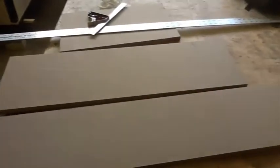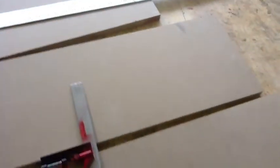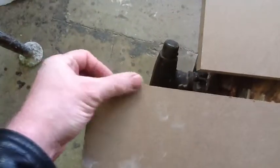You can make these out of pretty much anything. What I've got here is some press board, which is very similar to what you would have on a clipboard that you'd write on in class. I'm going with a 17-inch length — I've measured the 17 inches here and used a square ruler to create my draw line. We're going to be cutting on a table saw. Whenever you cut on a table saw, the blade spinning is going to cause the cuts, so you want the presentation side on top. You can see how the table saw roughed up the edges on this next board, so we're going to flip it over when we work on it — notice how much cleaner and nicer these edges are.